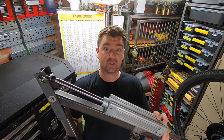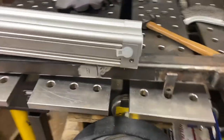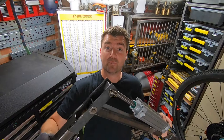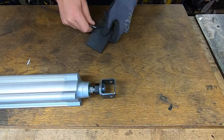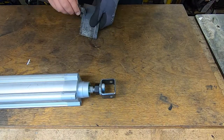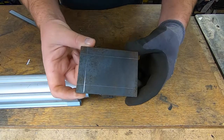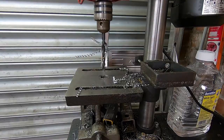That's the front of the cylinder mounted. When we mount the back of the cylinder we need to be careful that we don't mount it in the wrong place, meaning the cylinder gets damaged when it moves. We're making a backing plate for the cylinder and also a simple hinge, since just like the front of the rod, the back of the cylinder also needs to pivot slightly.